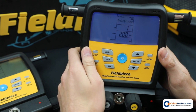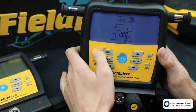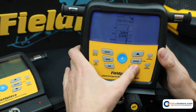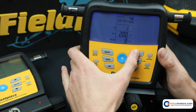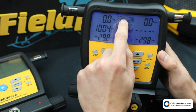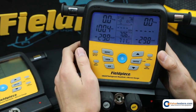This will not let you start a datalog if it doesn't have memory to finish it. So it's always going to dynamically adjust the interval so you get the complete data range. So you just select whatever time you want to log, hit enter, and now you're good to go. You see up there it says log and it is logging data with however you specified.